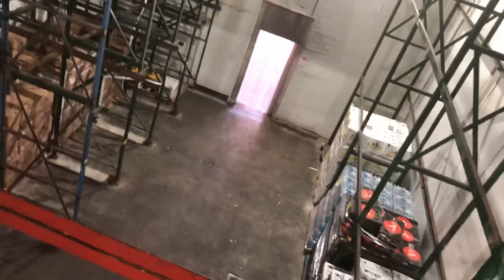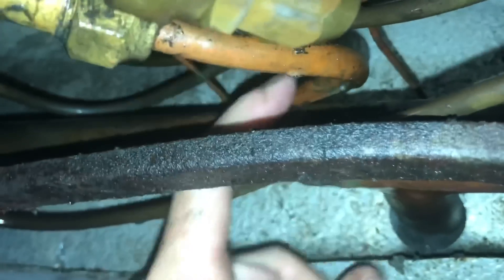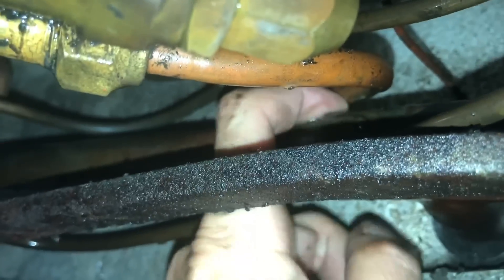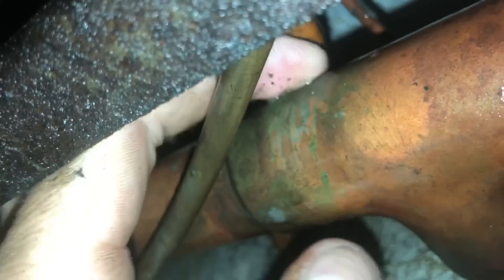What's up boys, welcome to the stock. I'm up here on the lift — got a leak in this thing, oil everywhere. We got a wicked old system here. This is our expansion valve. Here's our liquid line, this is our suction line. The liquid line right here was rubbing on the suction line; I just had to raise it up right in here.